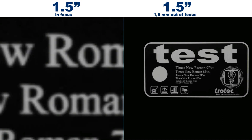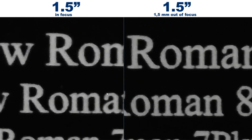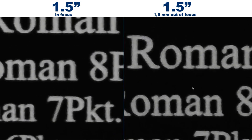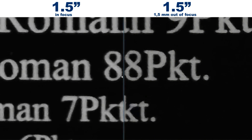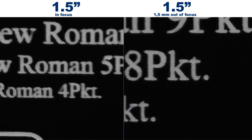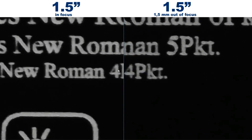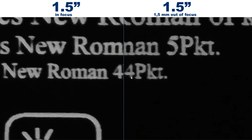With the larger text there is not really much of a difference. If we look at the 8 here, we can of course see that there is a slight difference, but not much. However, if we move down to the smaller text — let's take the number 4 here — we can see that we have lost a bit of details, here at the bottom for example. This is quite good bearing in mind that the dimension of the number here is 0.48 millimeter by 0.63 millimeter.